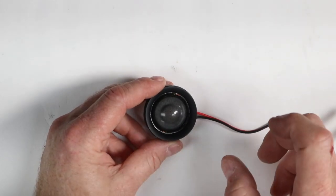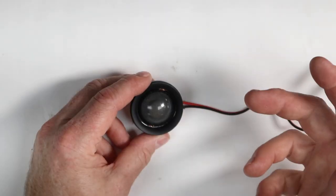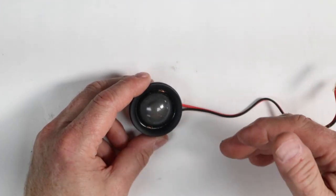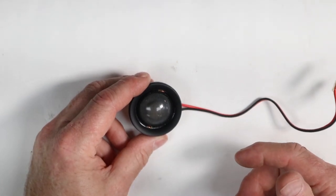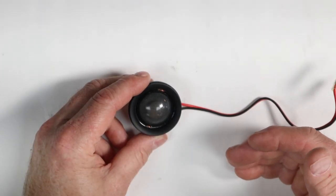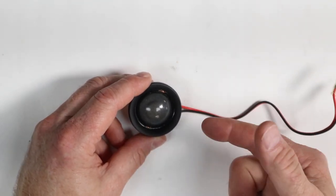This adds rigidity and, of course, dampening. This greatly improves the clarity and the bandwidth of the tweeter. Take that along with the Hexatec aluminum voice coil, which is made from 100% aluminum shaped like a honeycomb. This reduces air gaps in the coil windings, thereby increasing efficiency by up to 20%. This makes it lightweight, which is largely responsible for the extraordinary fast transfer response that the tweeters are known for, which is one of the reasons why I like these.